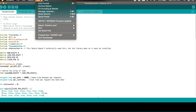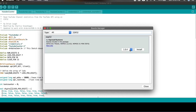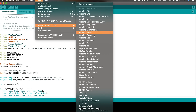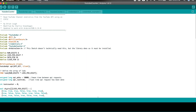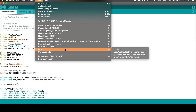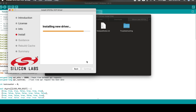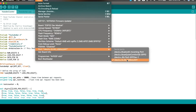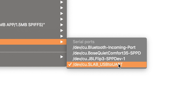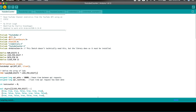Once you've entered the new URL, click the OK button and go to Tools, Board, Boards Manager. Here you'll need to search for ESP32 and install the one by Espressif Systems. Once that installation is completed, go back to Tools, Board, and select ESP32 Dev Module. Most of the settings that show up should be OK the way they are, but we're going to have to select the port that the board is connected to. If you don't see your board in the list, you may need to install the USB to UART bridge driver from Silicon Labs — go to the link in the description and download the file corresponding to your operating system. Run the installation and restart the Arduino IDE. When you return to Tools, Port, you should see an option for SLAB USB to UART in the drop-down. With the port selected, make sure the programmer is set to AVR ISP Mark II and you should now be able to compile the project and upload it to your board.